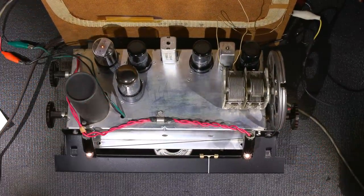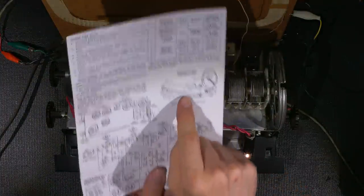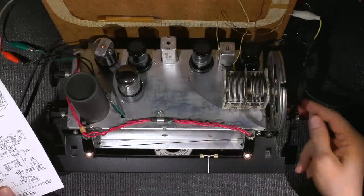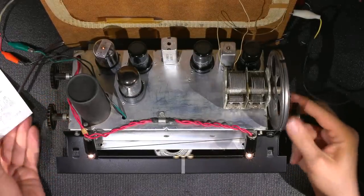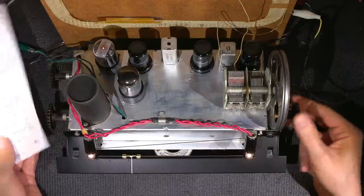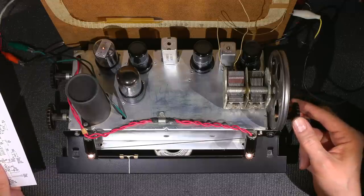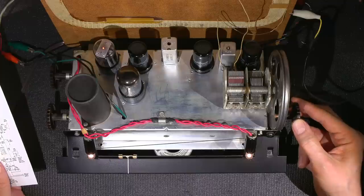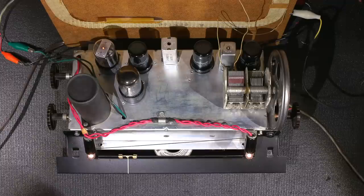So I'll put this back down here again. I'll move my signal generator to 600 kilohertz. And now I need to move this down to the second mark. So let's see if we can hear any signal down there. Very close, look at that. So I might be able to touch that up just a little bit.